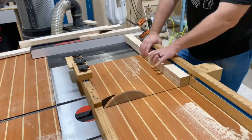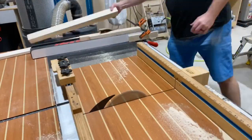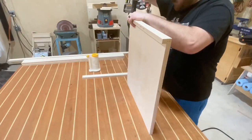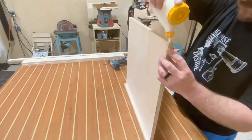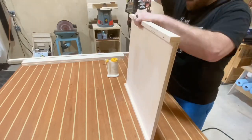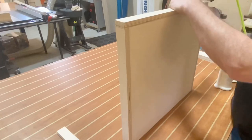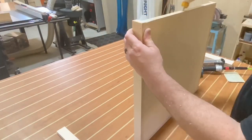Now that the legs are dry, I've cut them in half and I'm going to run them through the table saw, all set up with a stop block as you see on my fence. Now all the legs are the same length. Now you see me installing the trim. There is no other material in this build other than plywood. That's it. Plywood can be beautiful if it's used in the right way.